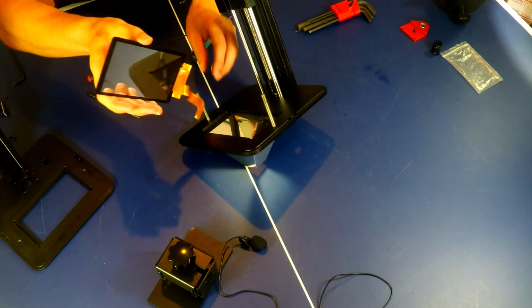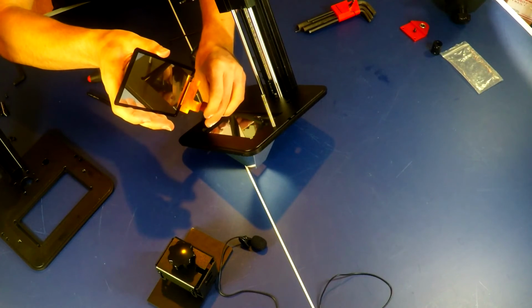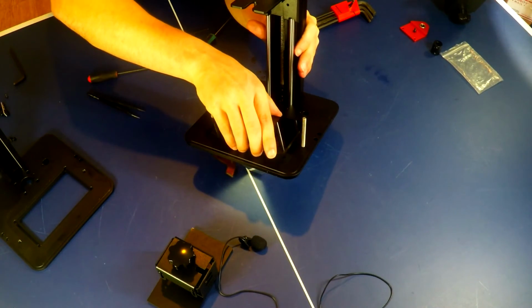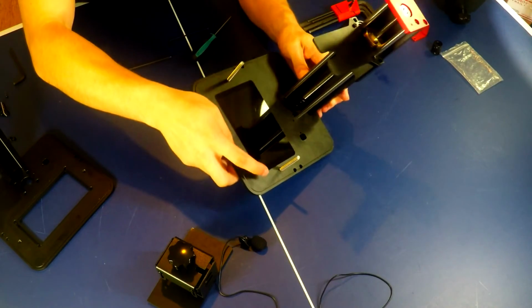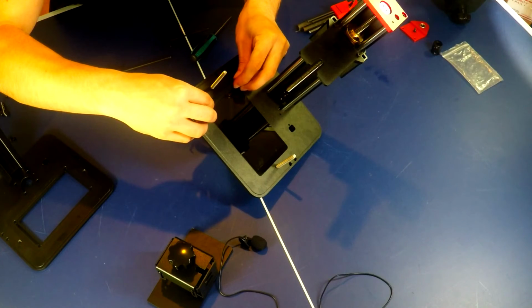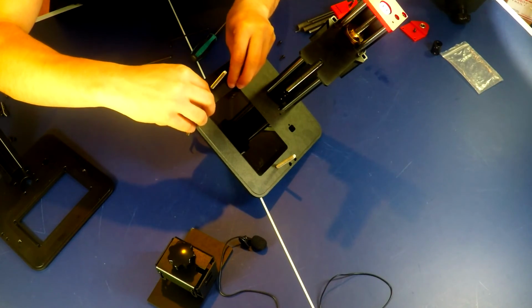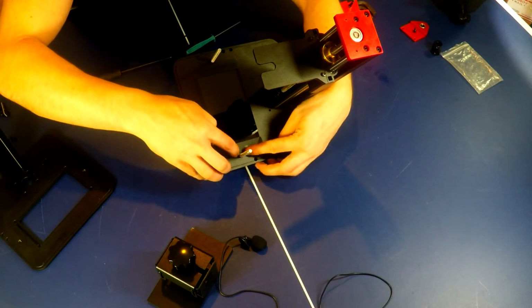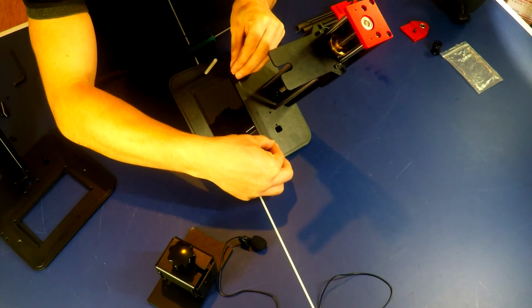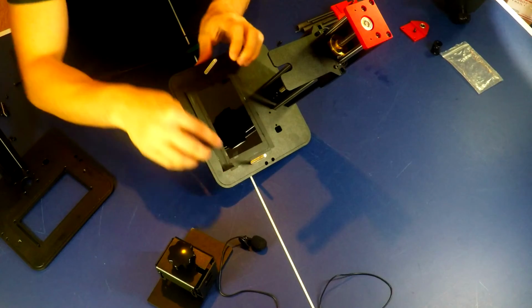Time to tackle what is probably the most delicate part of the reassembly, which is putting the LCD back in place. Make sure no dust has collected on the back of it. Place the ribbon cable through the supplied hole and you'll find it slots into an exact position. I recollected my original electrical tape and very carefully placed it around the 4 edges, making sure it was flat, it wasn't fouling the mounting screws for the VAT, and that I wasn't getting any fingerprints on the LCD at all.